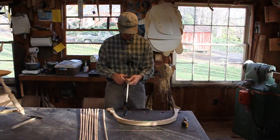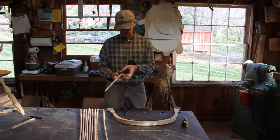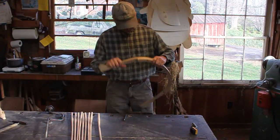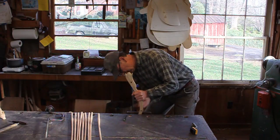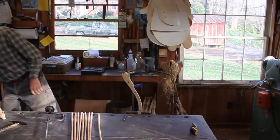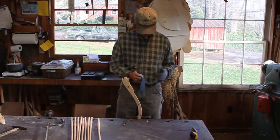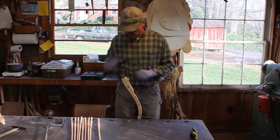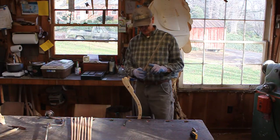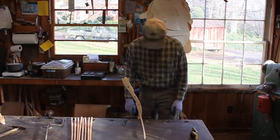I don't know about using a bit brace with this, but the tang would fit through — you could cut it off or make it fit a universal chuck, but they sure do work nice right in the spot. So I've got that mounted. I'm going to take the third hole and have it just barely sticking up, about like that. I'm going to put my grippy gloves on here because I'll be working that spindle in and out, and it hurts my elbows. The first thing I'll do is check it — that's a 7/16-inch hole and I fit this to a 7/16-inch hole tapered with the rat tail file.